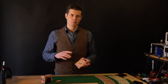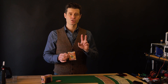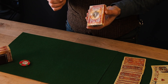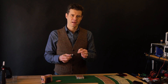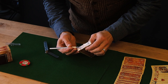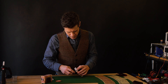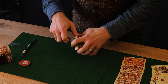There are two key things when building the Free Fall Deck. One, we want to get inside the cellophane without it appearing like it's been tampered with. Two, we're going to build a Circuit Playground and battery-based circuit along with an insert so that it matches the weight and feel of a deck of cards inside. I recommend using a hobby knife and a very small flat piece of metal to help lift up the seam at the bottom. There is a small flap that can be lifted up — start the cut with the knife, then use the metal insert to carefully pry up the plastic.